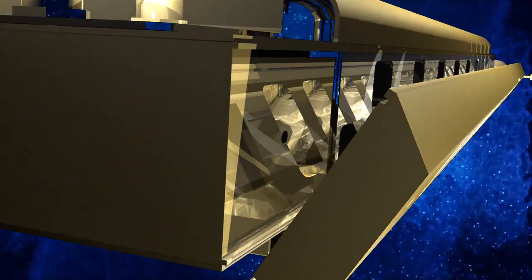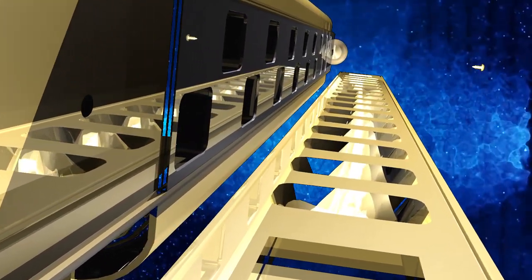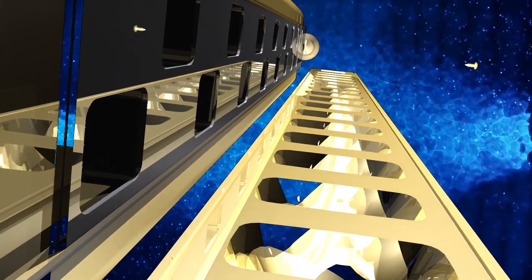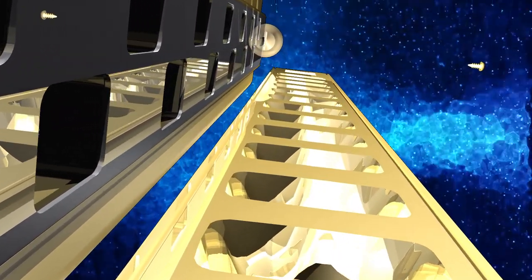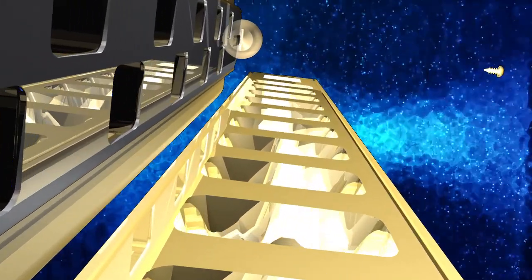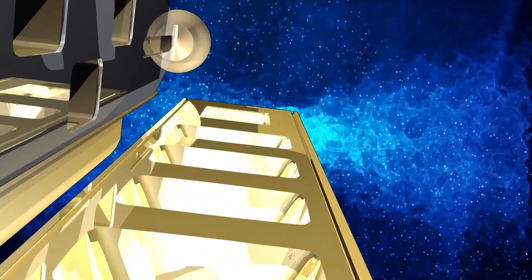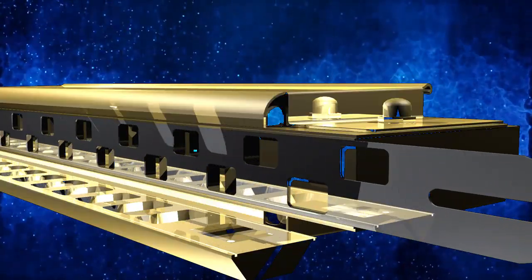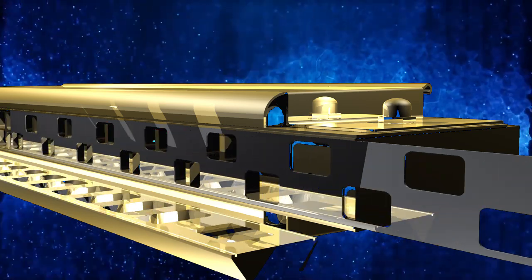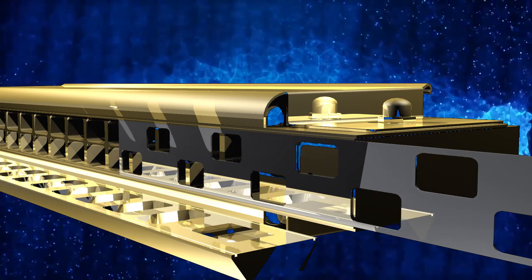The mouthpiece is a solid, beveled brass part that rests on the edge of the comb over the air channels. The round holes, smoothly machined for better and more comfortable tongue blocking, pass through the mouthpiece, widening out to match the larger openings of the channels in the comb. Set between the mouthpiece and the comb is where the carbon steel slide sits. The slide is the only movable part of the harmonica, used to shift between sharps and flats and natural notes.